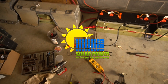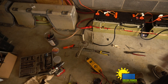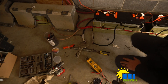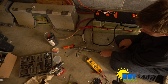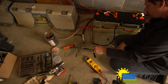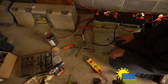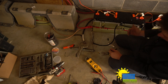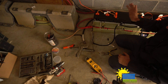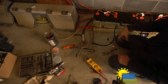What we've got here is a homemade inductive resistive load burner. There are a couple of ways you can balance these batteries and I've made it just as simple as I could. We've got positive and positive connected between the two battery banks — the larger battery array from the Chevy Volt DIY battery power wall — and this is about 33 kilowatts of power, divided between two 16.5 kilowatt battery packs.